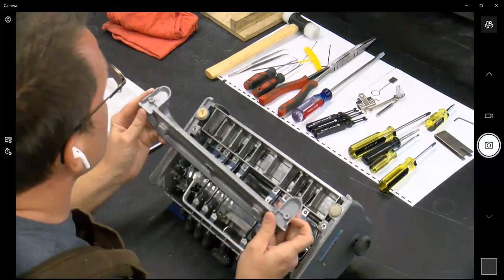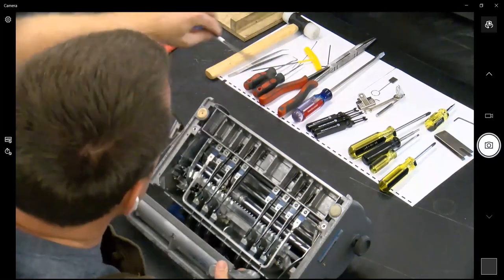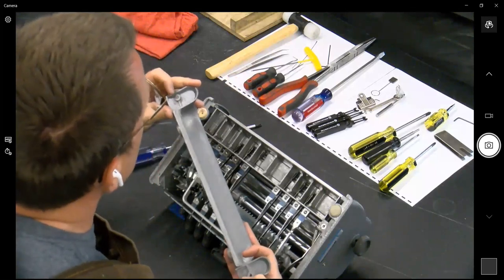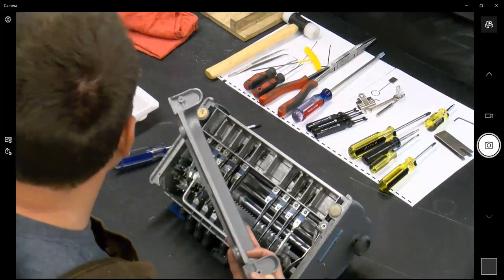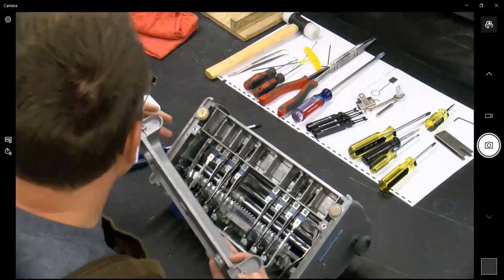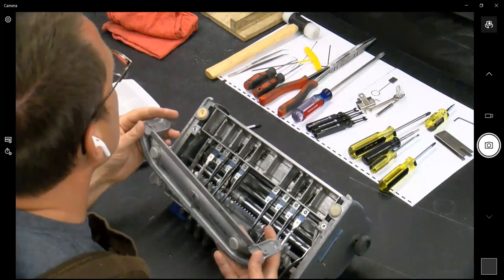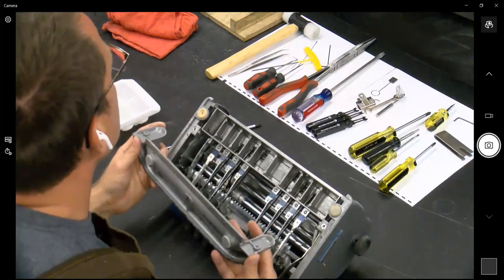Examine especially the inside of these screw holes inside the casting — they get grime in there. Sometimes they get little pieces of metal from the casting or the screw itself. Examine your screws — if any screw has warping or grime, clean it before you put it back in. Sometimes I put a little dab of rubbing alcohol, which is what we mainly use to clean the majority of our braillers. It will eventually evaporate, so no harm, and it doesn't cause corrosion.